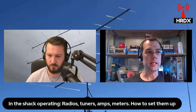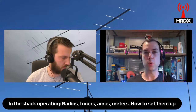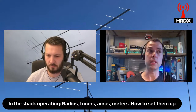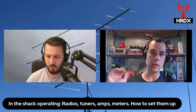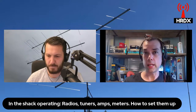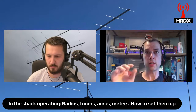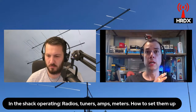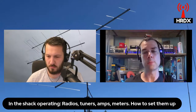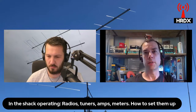Back to the car metaphor — your engine creates a lot of heat to the point where it needs a cooling system, and your radio does the same because you're wasting energy with an improper SWR. When you put the antenna matching unit in, you're using a device that's more efficient at matching both the antenna and the radio. Your radio is able to put all its power into the matching unit, but it's still not necessarily putting all that power out into the antenna — so you're making your radio happy but not necessarily making better contacts.